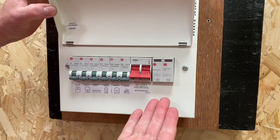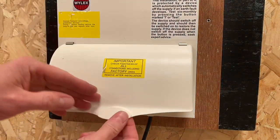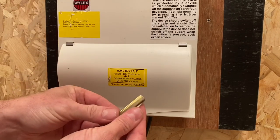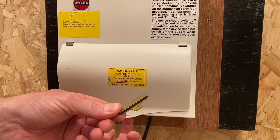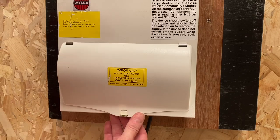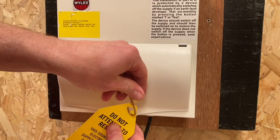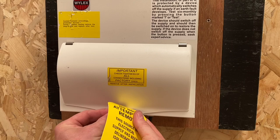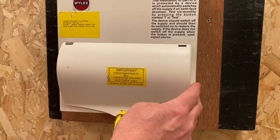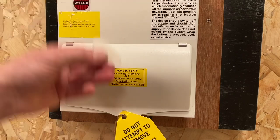If we wanted to have a fully isolated board or just one circuit off, we come to this little feature here. With the board de-energized, take off this flap, then take this handy little piece and slide it under the back part of the lip of the lid like so. Line it back up and now take your padlock and sign — go through there and drop it into the hook, remembering to keep the key in your pocket. Now I've actually secured the isolation of the entire consumer unit. Just make sure you keep hold of that flap — you don't want to be looking for it later.